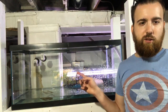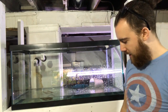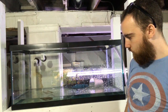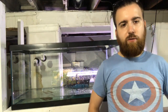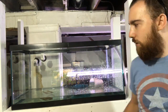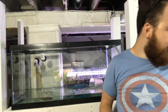600 gallons per hour gravity fed. So the 1-inch overflow will handle this times 2, what I have coming out of here. So it's definitely more than enough. I just don't know the gravity flow rate. That will be not pressurized. Yeah, it's just going to be gravity fed. There's no pressure behind it. So that's basically it with that.